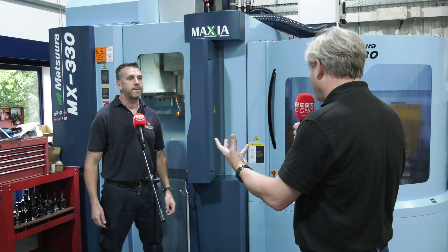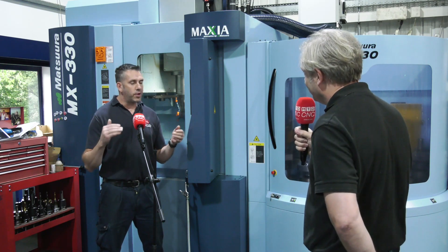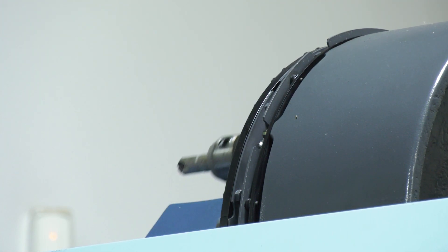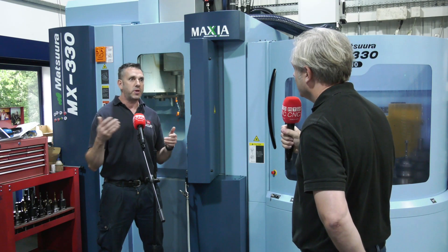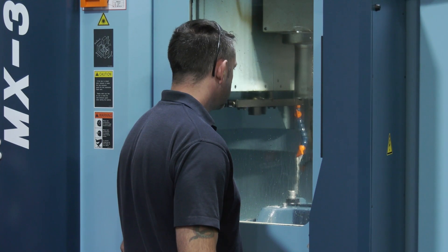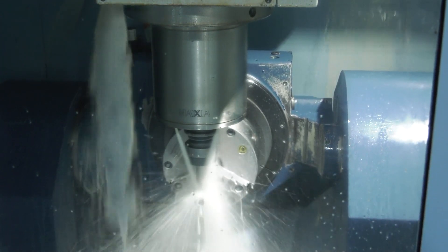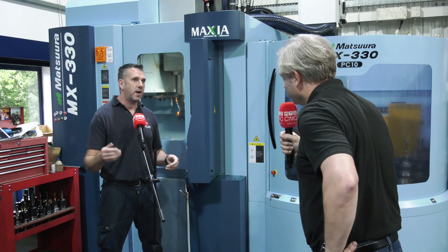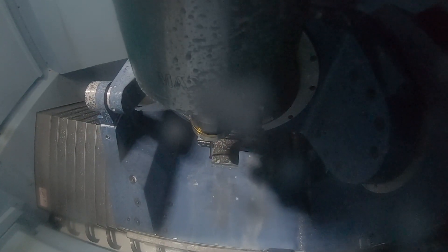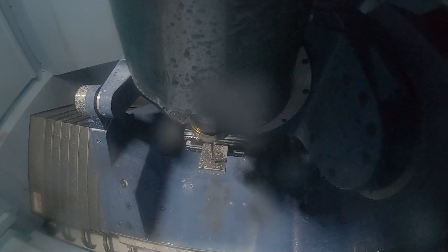Going back to the fact you used to do a lot of oil and gas — I'm thinking big components, big depths of cut — this machine represents another slight change in strategy? Yeah, that was more of a learning curve for the machine. In the past it was about getting the metal off as fast as you can, but with this it's more about tool life, because you want to be able to walk away from the machine to get its full potential. If the machine's got to stop every ten minutes for a tip change, it's not going to work. So with the ten pallets the cycle time has gone up a little compared to a single pallet machine — you take smaller cuts, focusing more on tool life. You've got your tool management, and the laser there to check for tool breakages, so you're not coming back to the machine. If you need heavier cuts, the single pallet machines are good for that. We'll keep the heavier work for the single pallets and the more intricate work for this.